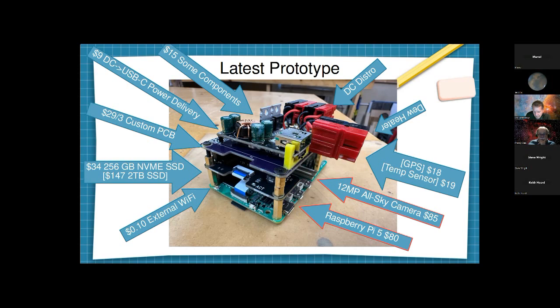And the power board says, hey, here's 5 volts. Raspberry Pi says, thank you for the 5 volts. Hey, this idiot plugged a bunch of stuff into me. I need more juice. He talks to the board. The board says, no problem. I got 13 volts available. How much do you need? He says, well, give me 9 volts. So it'll up itself to 9 volts and feed 9 volts in here. And that also works for the USB ports and everything else.